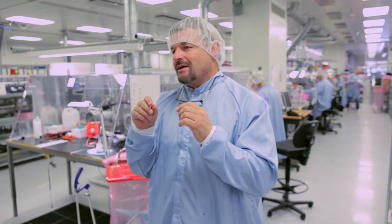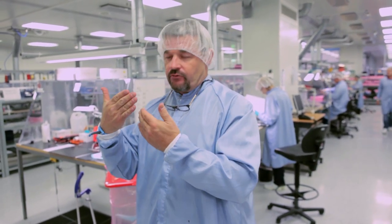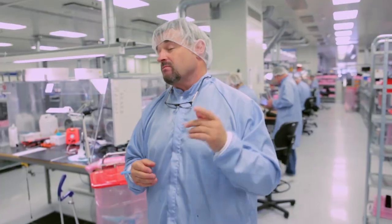What I thought was the coolest thing assembling an Aimpoint was putting the diode in and figuring out how it projects against the lens. They calibrate it to achieve absolute bare minimum parallax. There are five holes across the front of this plate that project five dots, and they correlate them together at infinity. Back in the day they used to eyeball this at a great distance; now they calibrate it on a machine, which is much more parallax-free. As I tell my students: always keep the dot in the center 50% field of view, like looking through the donut hole. When shooters get into different positions with a long gun, parallax comes in when the dot drifts into the edges or the donut ring of your field of view — and he confirmed that's a good way to look at it.